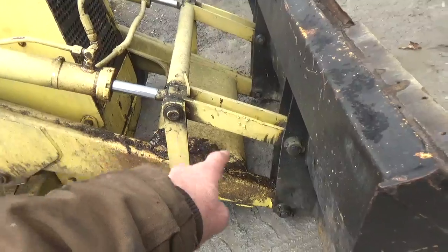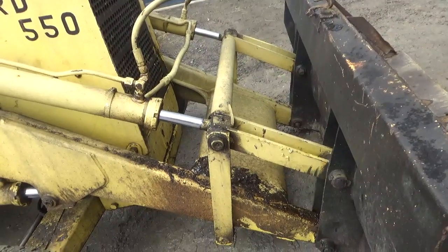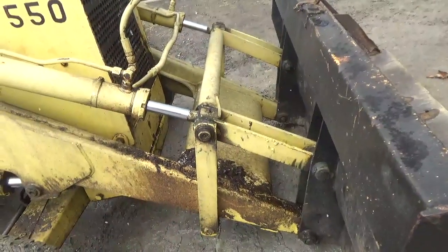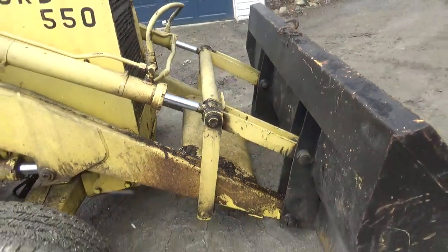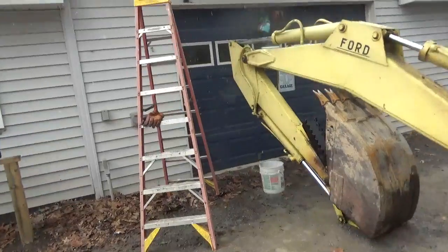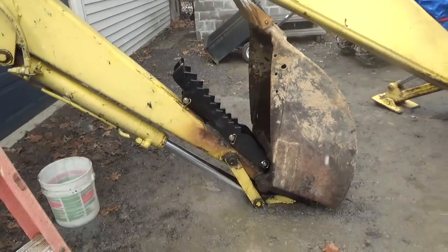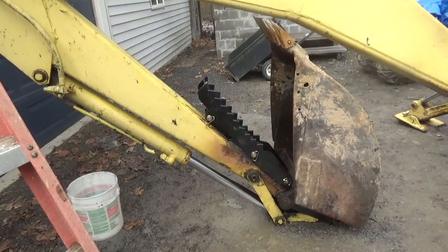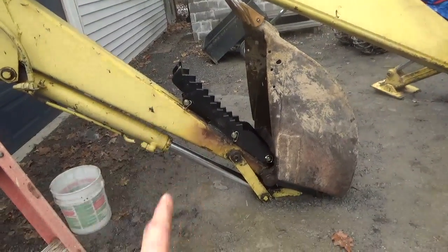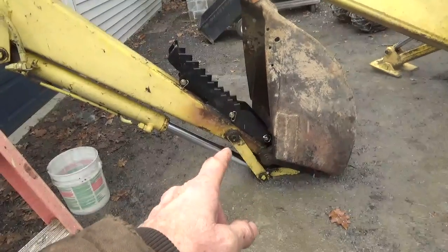Same thing, this piece that they have in here, it's like a big oval that holds the arms straight and helps to take the load simultaneously into both arms, regardless of where it is in the bucket. I think it's fantastic. But nonetheless, the thinking with this thumb is that with those thoughts in mind and the thing that he brought up, I think the best thing to do would be, instead of using the very end pinhole, probably the lower pinhole would keep the stress down lower on the boom.